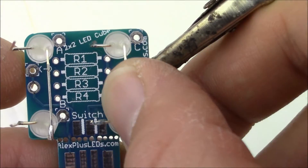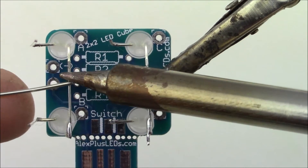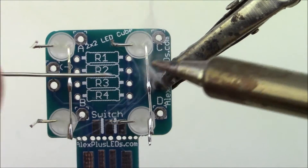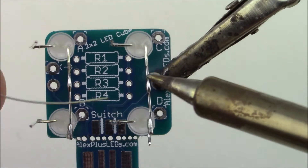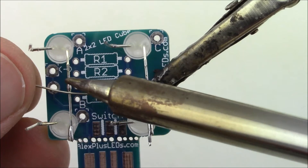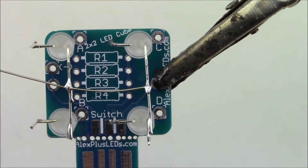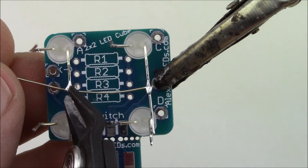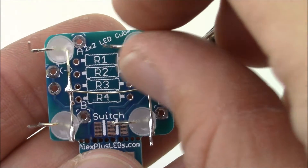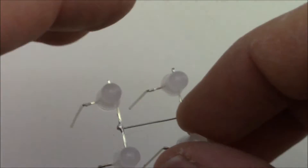Now place the four sections into the PCB and tin the center bits of the LEDs — just get a little bit of solder on each one. Then take a piece of bus wire and solder it in between the two sections. The tinned bus wire should easily solder to the two little blobs. Grab flush cutters and chop off the extra bit hanging off to the side. Do that for both sets so you have two four-LED sections.